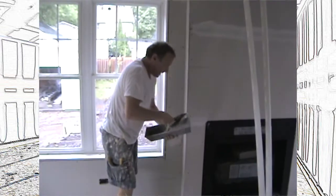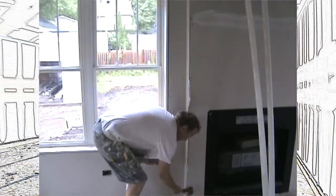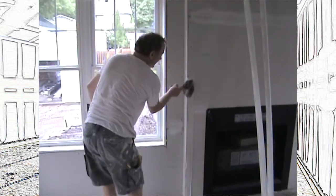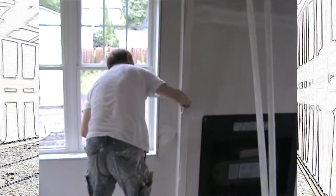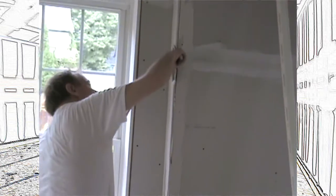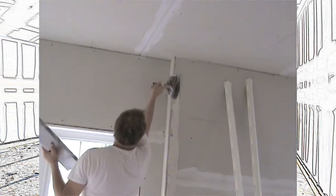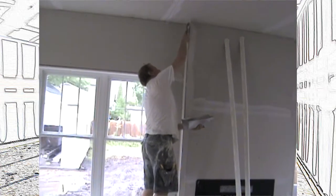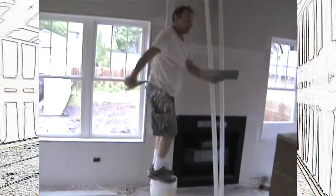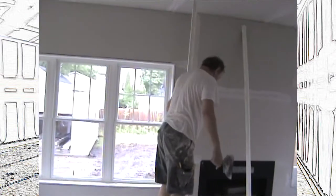I'm going to show you two ways of doing it. A lot of people think you got to sit there and fill this whole thing in — you don't. What you got to do is mud up each side, all the way up and down, both sides. And you need a bucket. Now, I understand these are nine-foot ceilings, so I had to put two buckets together so I can reach nine foot. I was told one day, 'Oh, you're the bucket walker,' because I can walk on a bucket. I've been doing it for years and it's not hard to do.